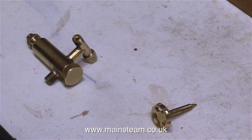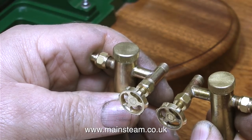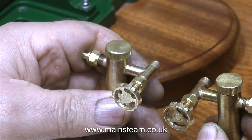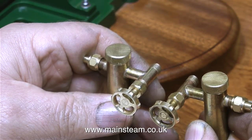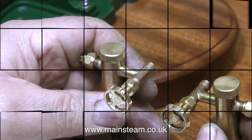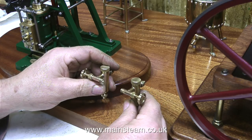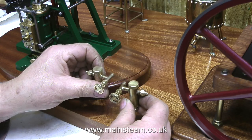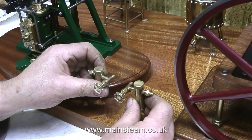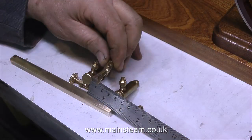While on the subject of top tips, it's a good idea after working on a part like this in the lathe to blow it through with an airline to get rid of any particles of metal. But it's not the end of the world with a steam engine — the first thing that happens is steam goes into the steam chest, condenses to water, and that washes any foreign bodies out before the engine even starts to run. I'm proudly showing off my handed pair of displacement lubricator steam tap combinations. I really did think it would be a good idea to retain the use of these, because they're genuine Cotswold Heritage lubricator valve units — so now we just have a slightly modified pair of Cotswold Heritage lubricator valve units.